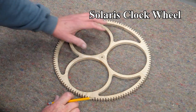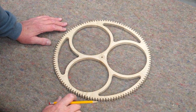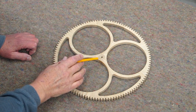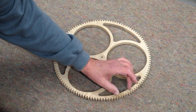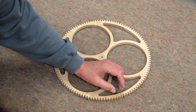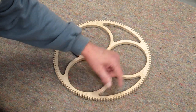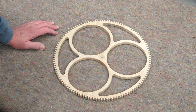In a perfect world, how would we make a solid wood wheel with less chance of distortion or humidity changes? The wood grain on this wheel is radial — it runs out in this direction. So when we get out here in the rim, changes in humidity or weather cause this wood to expand and contract quite a bit in this direction, and that can cause us to split. That has not happened yet, but it could.